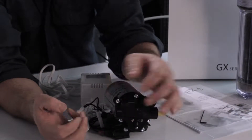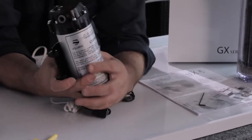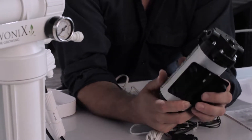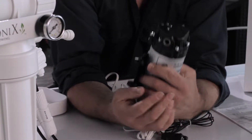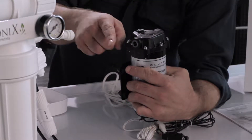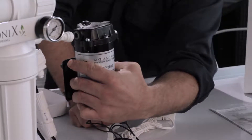Pull out the yellow safety caps and install the pump. This pump can be screwed to the wall — it has rubber feet on the bottom. You could mount it to a wall next to the RO filter. The input is on the right and the output on the left, and that goes into the RO unit right here. That's how the 1530 will plumb in.